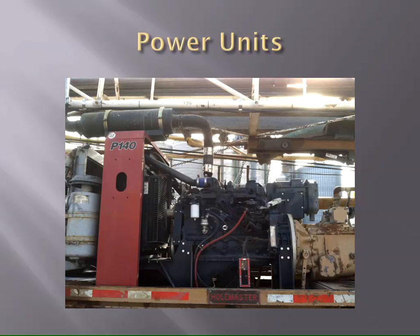One of the things we did early on: this rig had the original four-cylinder Detroit engines. We wanted more horsepower, especially since there are two power units — one runs the compressor and centrifugal mud pump simultaneously when jetting. We went with an Iveco engine mainly because of cost — bought it from our Case IH dealer. We cut fuel consumption in half over the old Detroits and got more horsepower. These are somewhat throwaway engines, but we got a lot better fuel efficiency.